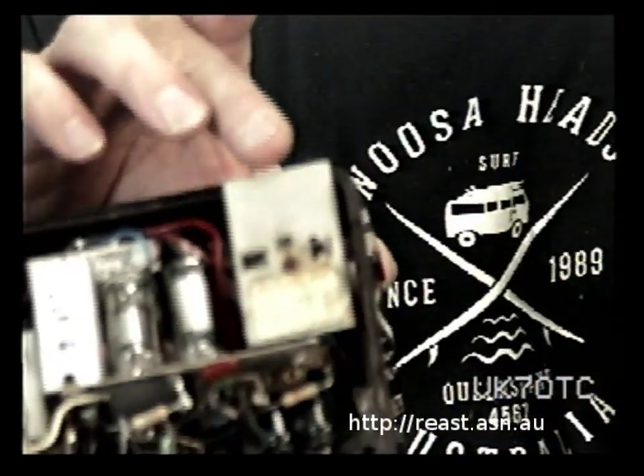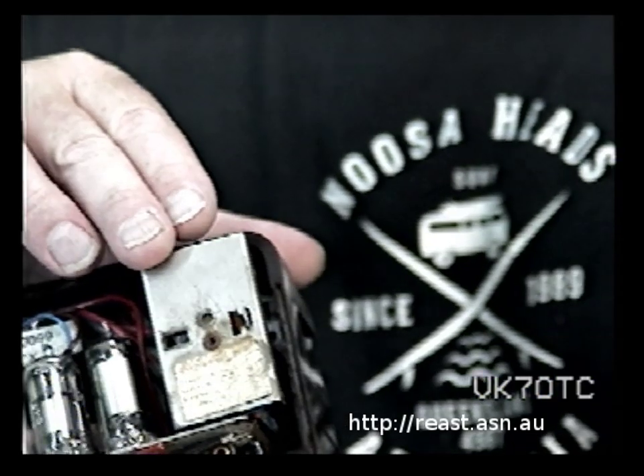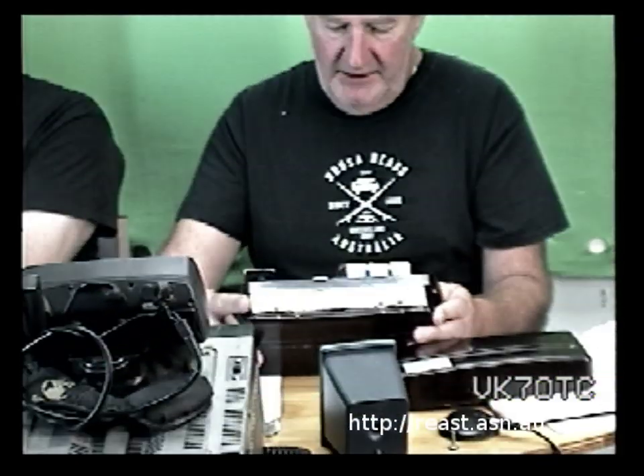On the other side under this very badly designed panel there are supposed to be two standard D-sized batteries. This metal panel has two little weird clips and sits right next to the audio amplification tube. I'd be surprised if many owners didn't smash their valves while changing the low voltage battery. The low voltage battery lasts much less time because the tubes pull 250 milliamps. So rather than use D cells, I've built a little pack of three alkaline AA cells — much easier to open and change, and far less risky to the tubes.